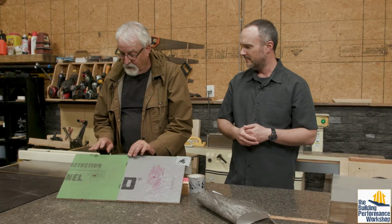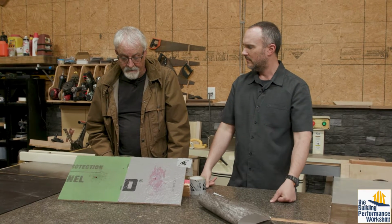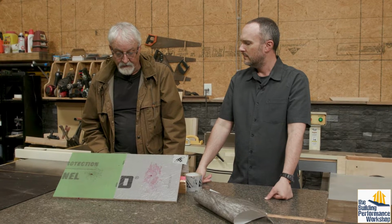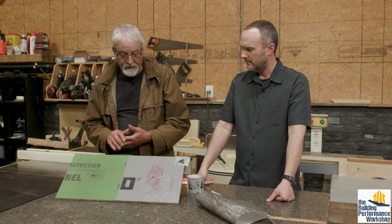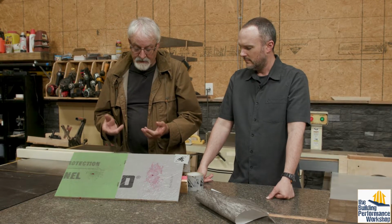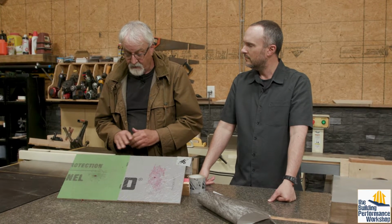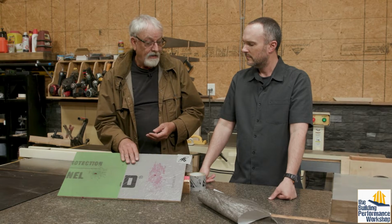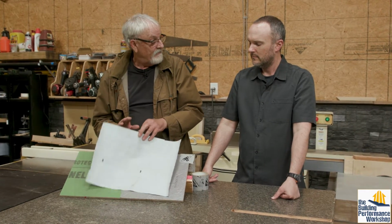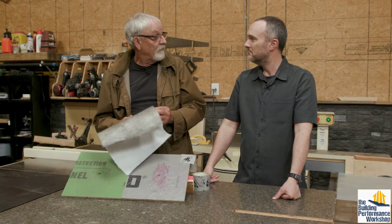Right. I think the most important thing if you're choosing an integrated system is you're going to get a tight house if it's installed correctly, probably below 3 air changes per hour. So you need to think about bringing in fresh air with ventilation and maybe some dehumidification or humidification. Also, if you're using an integrated system with reservoir type cladding, stucco, brick, masonry, it's probably a good idea to put another layer of something, be it house wrap, felt paper. I really like felt paper because it's got a throttle in it when it comes to permeability. But it's a good idea.